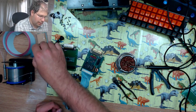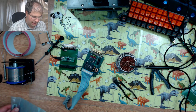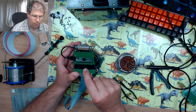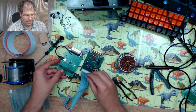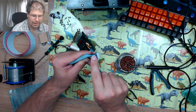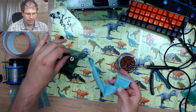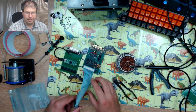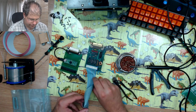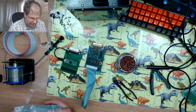So yeah, it is a dummy pin. I mean, it does have a lock on the front just here. So therefore it can only go in one way. But yeah, it does help when the cable is twisted. So you can see as well on the cable that the outside is blue. So that same blue edge is the blue pin. So that basically tells you that no matter how many times you flex it and turn it, you're always going to get the same pin alignment at each end. So what we need to do now is build the ribbon cable assembly.